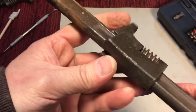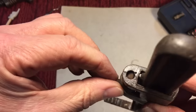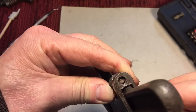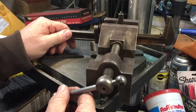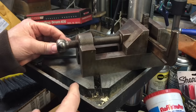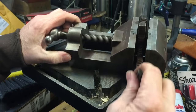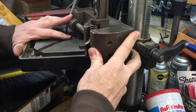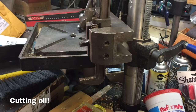So the first thing you do is back this all the way. Now we've got that peened-in area, but there's a floating pin in there. What you want to do there is take either the Dremel with a stone and go in and widen that out, or you could just take a drill that's the right size and drill it out. These vises here — this is from 1942, October 15th, 1942, right as World War II was just getting going. This is a machinist's vise, very handy, and I'll show you why. We clamped this in here, but we're going to flip it on its side, and that's what these vises are meant to do. We can clamp this to the table and rotate it under the drill bit so it'll drill without spinning around.